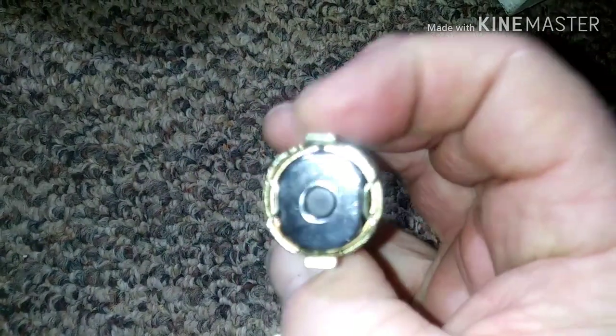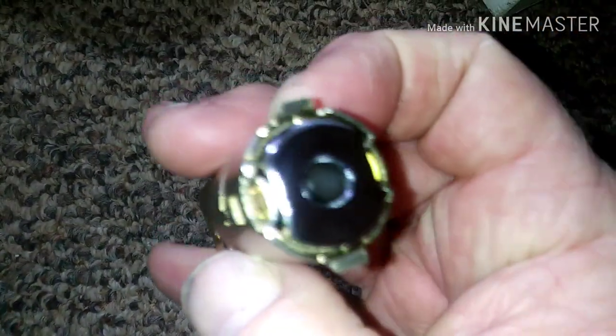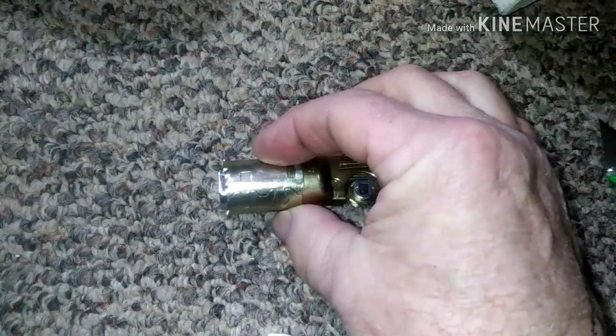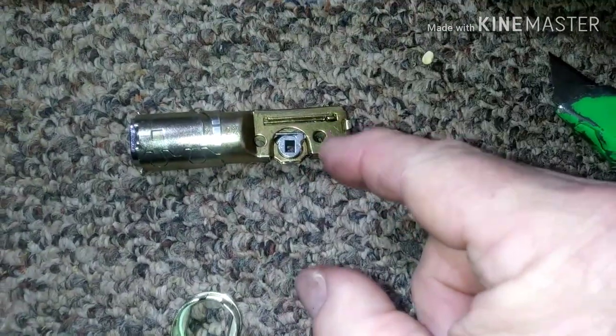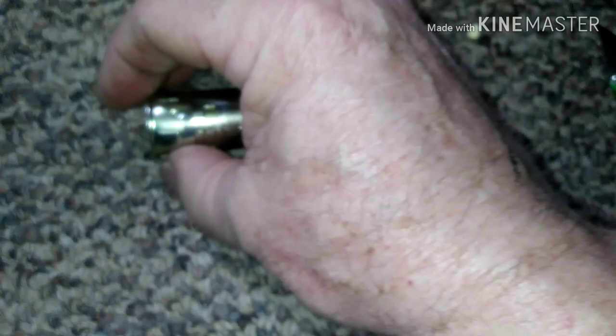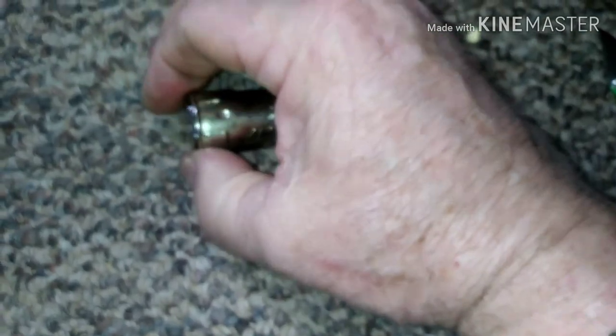On that cylinder you'll have two little tabs on the top — you can see them sticking out just a little bit. Inside the package there should be a little round ring that most people throw away, because obviously you don't need it for a wood door. The ring has two little slots in it to slide over those tabs.